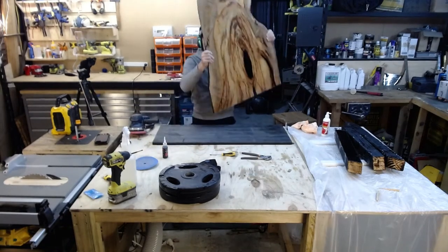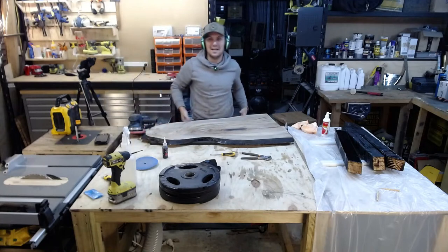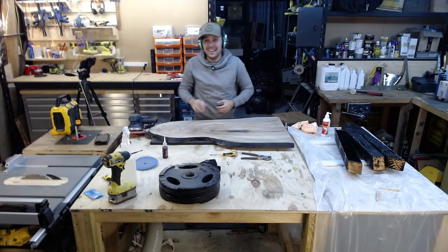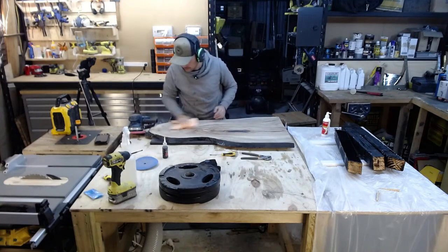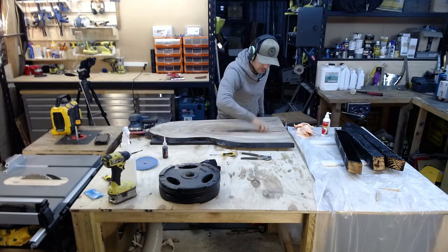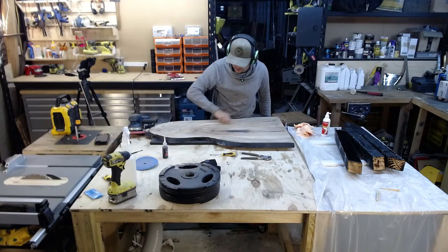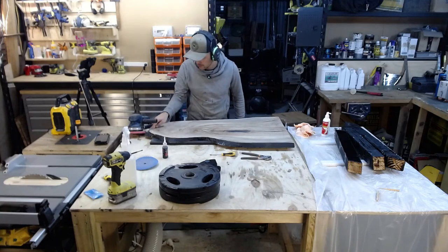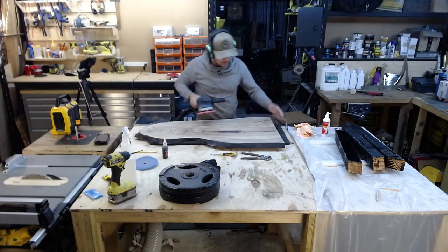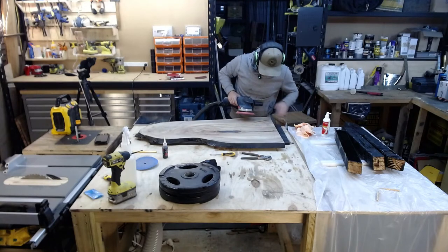Turn it around again, guys. Okay, anyway, wipe it off. By the way, guys, don't press really hard with that. Otherwise, it takes forever to sand out. So really just for marking, basically, so you don't forget anything. Your previous grit should be already pretty good. Getting it out should be with the 80 grit, 120 grit, and then with 180, you should just finish it out and get the scratches out from the previous grits. All the gaps and all the little scratches should be gone by then.